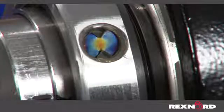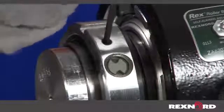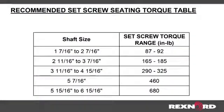You only need to observe a change in one of the visual indicators in each bearing. Once indication is reached, tighten the lock nut set screws to the appropriate torque. Disregard any change in color of the visual indicators at this point. Finally, tighten the mounting bolts of the housing fully.